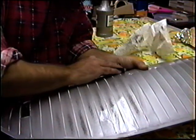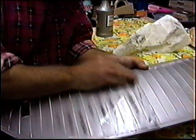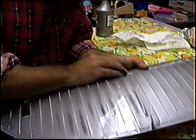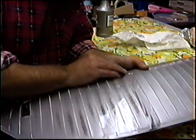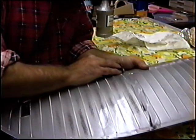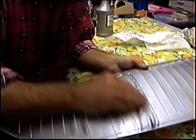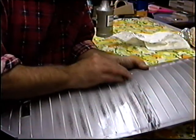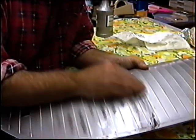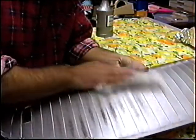One of the best tricks I know of is start real early in the morning, have your coffee, and because this is kind of a sit-down job, even though it's laborious, it's not heavy work. When you see a rainy day like that, I know there's no chance I can do any outdoor construction work, so I'm kind of locked in for the day doing my sanding. And actually, it is kind of nice and relaxing, up to a point. With each coat, sand just a little bit less. We're trying to build this up until the whole wing looks like it's machined out of one billet of aluminum, if possible.